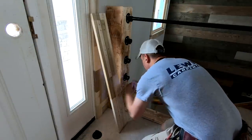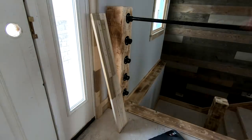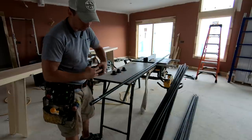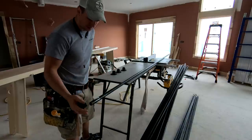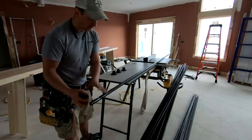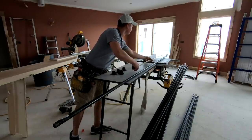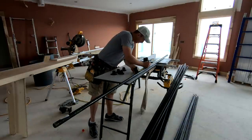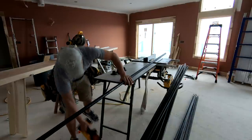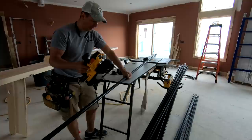By springing the line, I felt the thing that would work best would be to install the flanges on one side of the opening first, then insert the rod into those flanges and bring the rod around with the other flange on it and finish them off on the other side. The really nice thing about these brackets is they give you a lot of room to play with — there's actually almost an inch and a half of room in here, so you can have it only three-quarters of an inch in and still have the set screw hit the pipe. To cut these I'm just cutting them directly in half — marking 60 inches — and this bandsaw is absolutely worth its weight in gold.